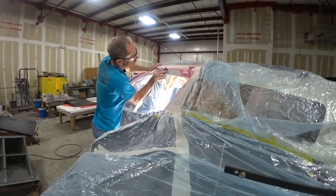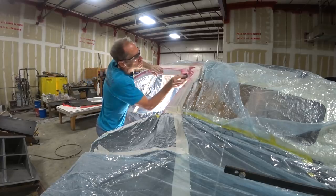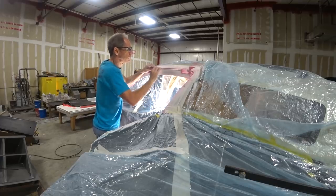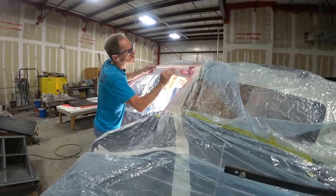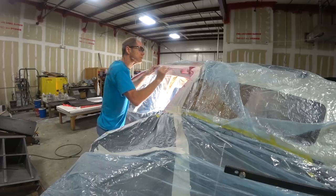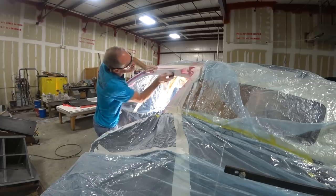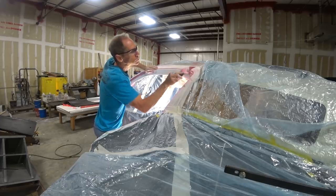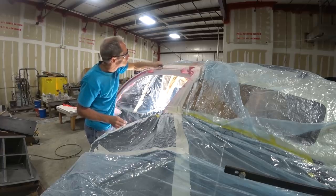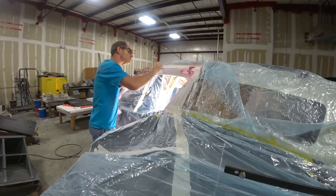On Tuesday, Devon was out sick and Jeff was taking a vacation day, so I was pretty much in the shop on my own all day. I had quite a bit of sanding underway, and did that for the first half of the day, getting this frame pretty much done. I decided to switch over to dry sanding — I'd done wet sanding on the other side, but dry sanding seemed to be working out better. I got most of this one done and still need to do a bit more tomorrow before being close to the next round of primer.